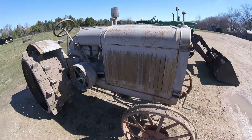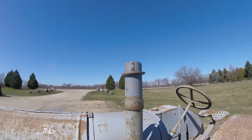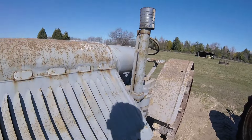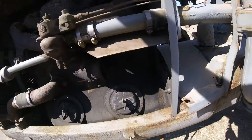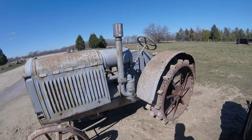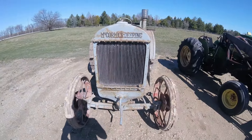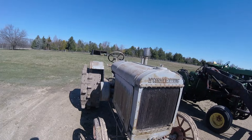The mag is still on. It's got the brass carburetor on it, which is good. The only thing we're missing is the upper air cleaner pipe or cover — we just got a can on it right now to keep rain out. We're also missing the exhaust tube that goes from the manifold, which is no big deal. I can probably make something up to fix that issue. We've got a nice little 10-20 to work on. The engine turns over — kind of just like our T-20, just a little bit older. Don't know if the mag is working; we didn't hear an impulse coupler, so we'll obviously get to work on this.